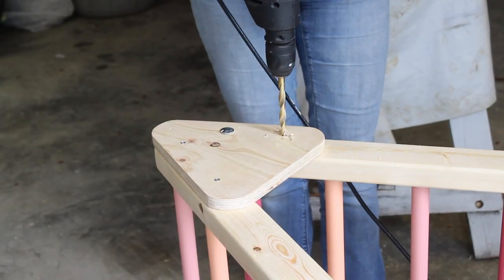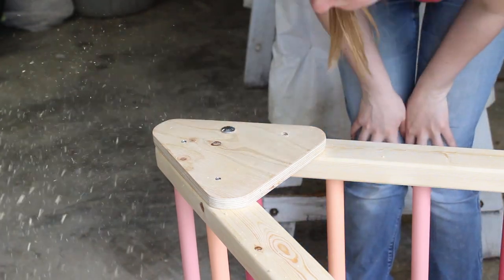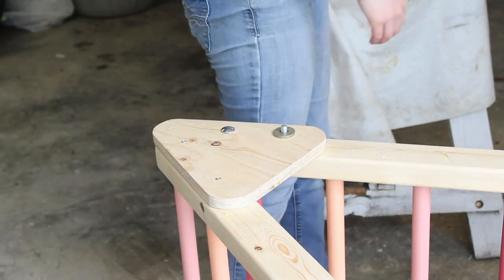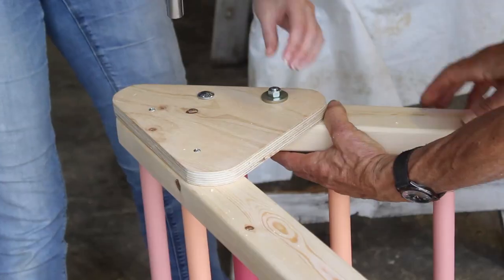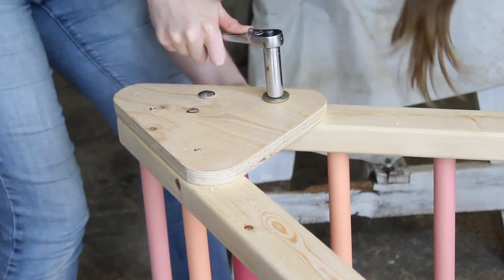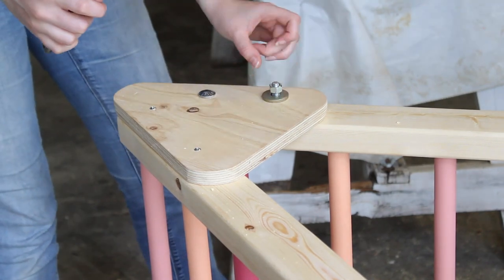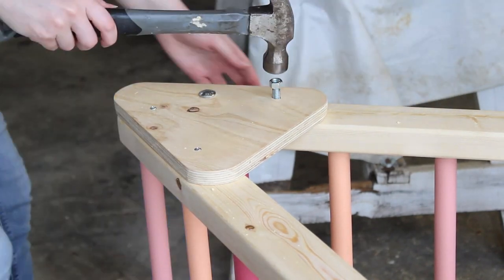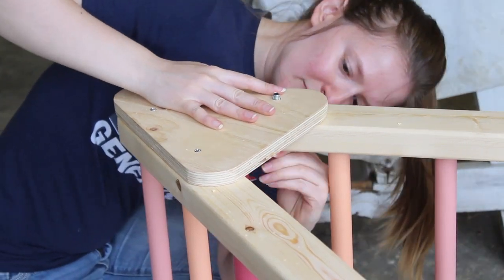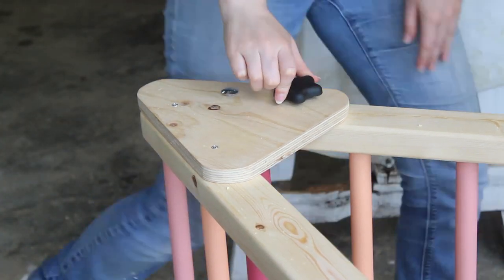The second two-and-a-half-inch bolt is used with the star knob. It's also three-eighths inch in diameter, so I once again drilled a three-eighths-inch hole. This bolt will go all the way through the wood only once it's fully embedded. Since it's not long enough to get tightened on its own, I tightened one of the three-inch bolts to create the proper dent for the two-and-a-half-inch bolt. Then I took that bolt out, replaced it with the two-and-a-half-inch bolt, and added the star knob. Once I'd repeated the process on the second side, the triangle was done.